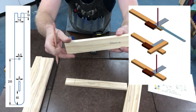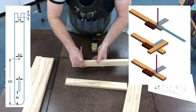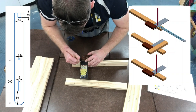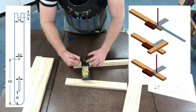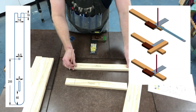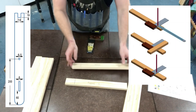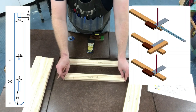We're going to extend that line all the way around, but we always work off the original line to make sure we're being accurate. Again with the trisquare, mark that so they all match up, then do the opposite side. Repeat the process on the other leg for frame A.